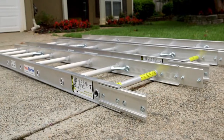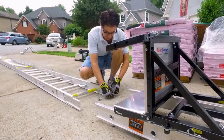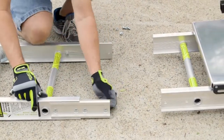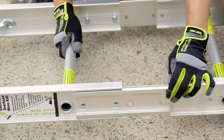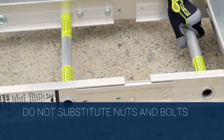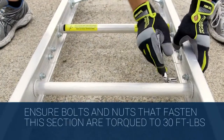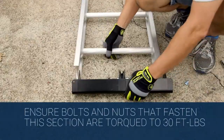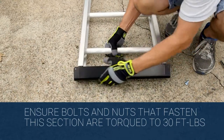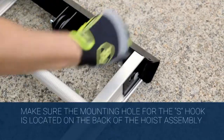Lay one track on a flat floor with the front side up. Attach splice plates to the bottom section of the track. Splice plates are mounted on the outside track section. Slide the top section track into the grooves on the inside track and attach with two nuts and bolts per side. Reattach the top cap to the end of the last section of track you intend to use. Assemble with the two carriage bolts with keeper nuts provided.